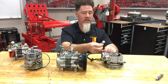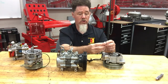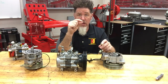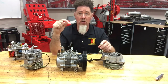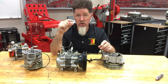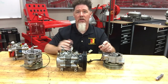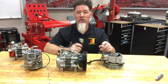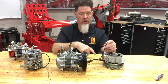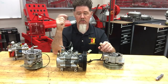Looking at another pump — here I have the thermal valve I took out. The key is that it's just a little temperature sensor, essentially a temperature switch. It's normally closed, so when you check it with an ohmmeter you should have very low resistance. If it gets hot it opens up. If you ever have one that's open, your clutch won't kick on — your fuse is good, relay is engaged, but no power to the clutch. It could be that your thermal valve got hot, went open, and never re-closed again. That's something to check.